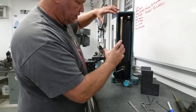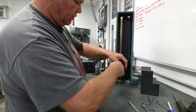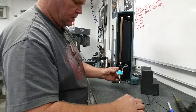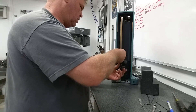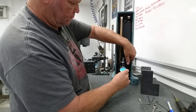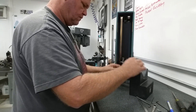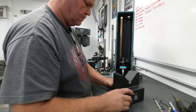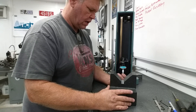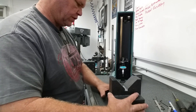On that axis, between this leg and the leg over here, we're golden. So now we're going to check it front to back, because we've reseated the column in there. We're going to adjust this back foot — I haven't done this yet. I want to make sure I'm within the travel of my adjusting screws before we get it all put back together and do another final calibration.